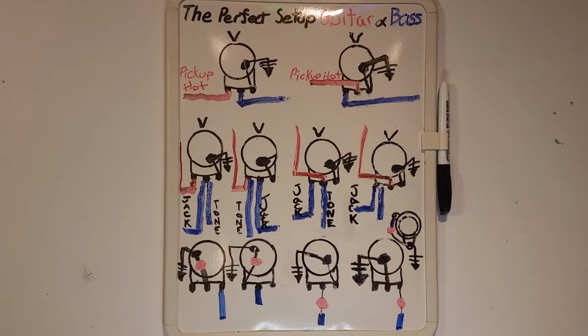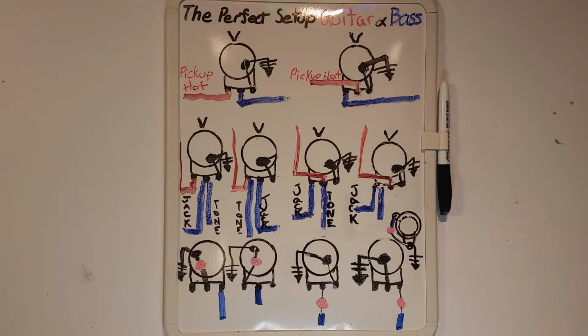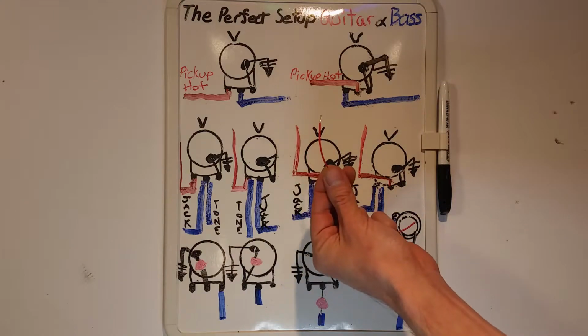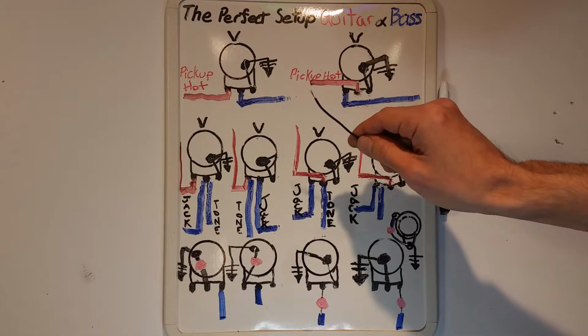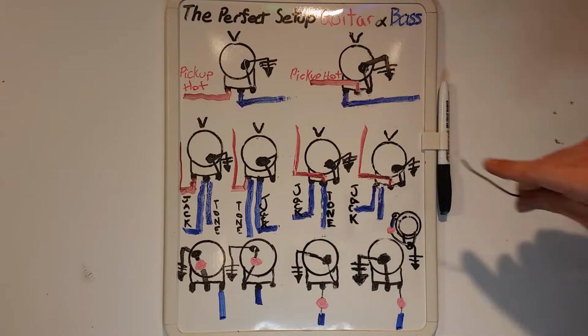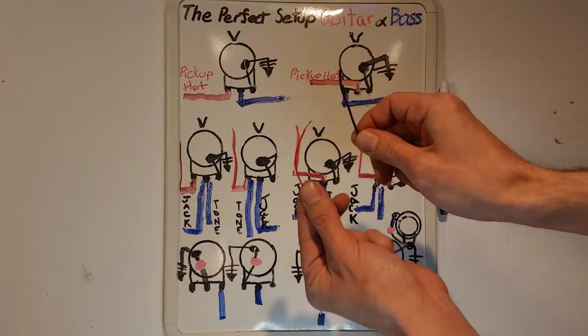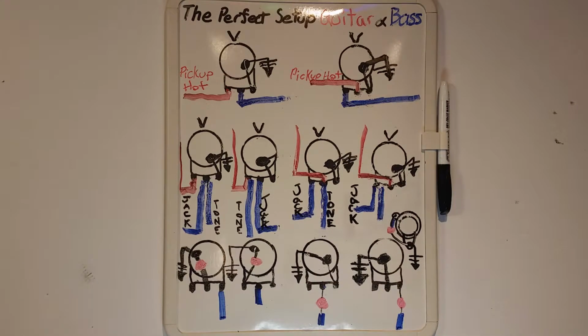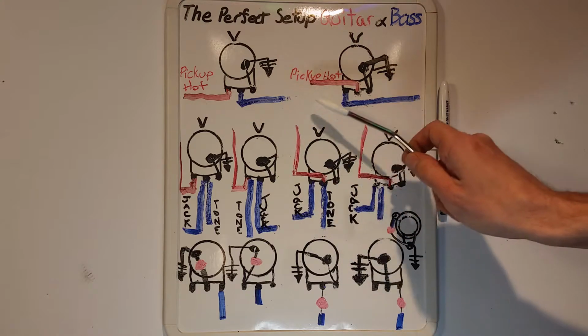First off, let me start out by saying that I'll be calling the negative wire a start or ground wire, and I'll be calling the positive a finish or hot output. The only thing negative about that wire is the name that it was given. If anything, there is more positive about that wire than the positive wire. In the diagram, black is ground, red is hot input, and blue is hot output.